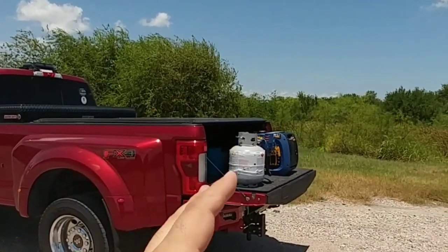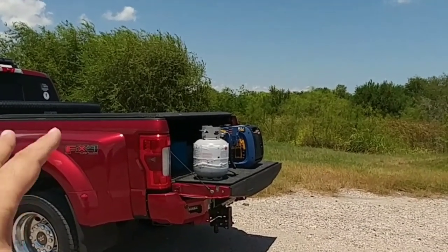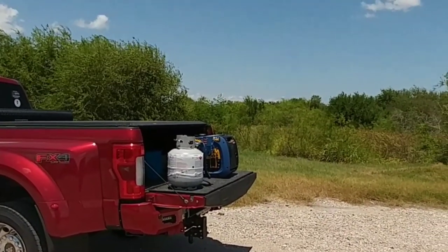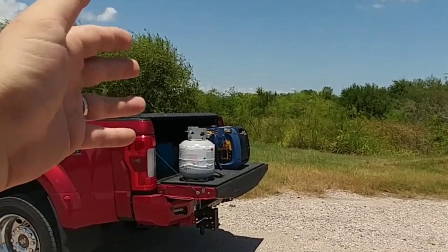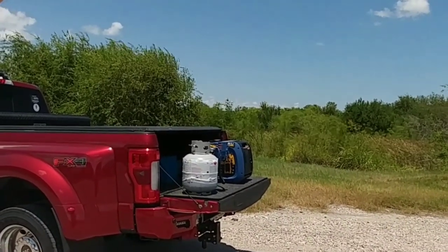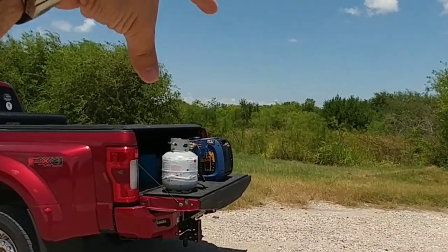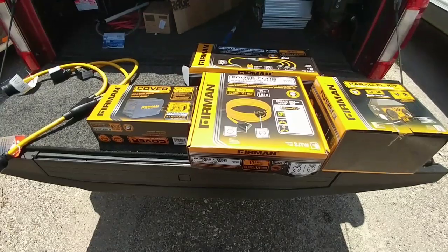It's a very cool generator. I love the fact that it's dual fuel, and where the real benefit of that is: if you run out of one fuel you have another. Some people see a propane-powered generator as a cleaner, easier-to-travel-with form of power generation, but what I like about it is you can use the fuel on board until it runs out and then connect it to a propane tank. You can carry two forms of fuel for a single generator. You'll run roughly 4 to 5 hours at half load on the on-board tank, then get another 3 to 4 hours out of the propane tank — giving you between 8 to 9 hours of power generation at half load without having to carry around a fuel tank of unleaded fuel that smells nasty, sloshes around, and isn't as safe.